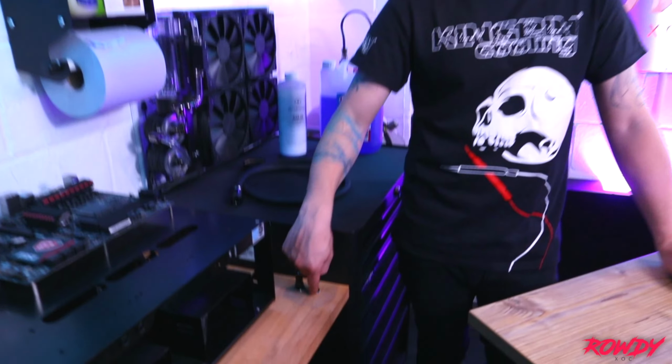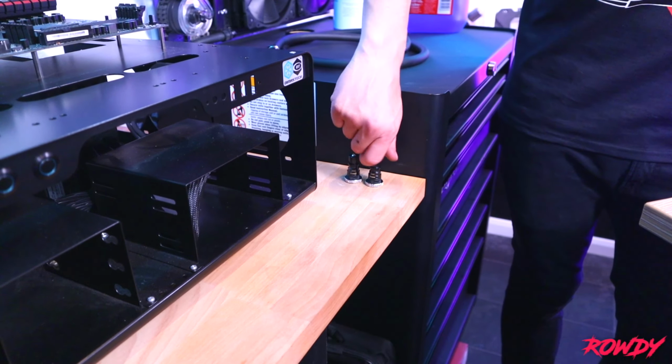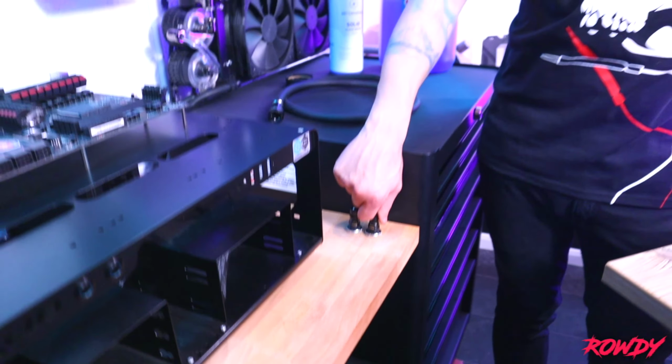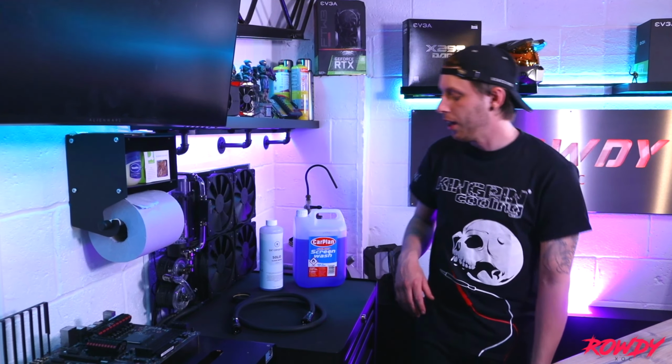Right guys, so quick disconnects are fitted. Very simply, it's a pass-through fitting which goes into a long spacer fitting into a 16mm fitting. On the top, we've got a small male-to-male fitting that goes into the male part of the Barrow quick disconnect. You will need male-to-male if you're going to go from pass-through to fitting, purely because they are obviously female.